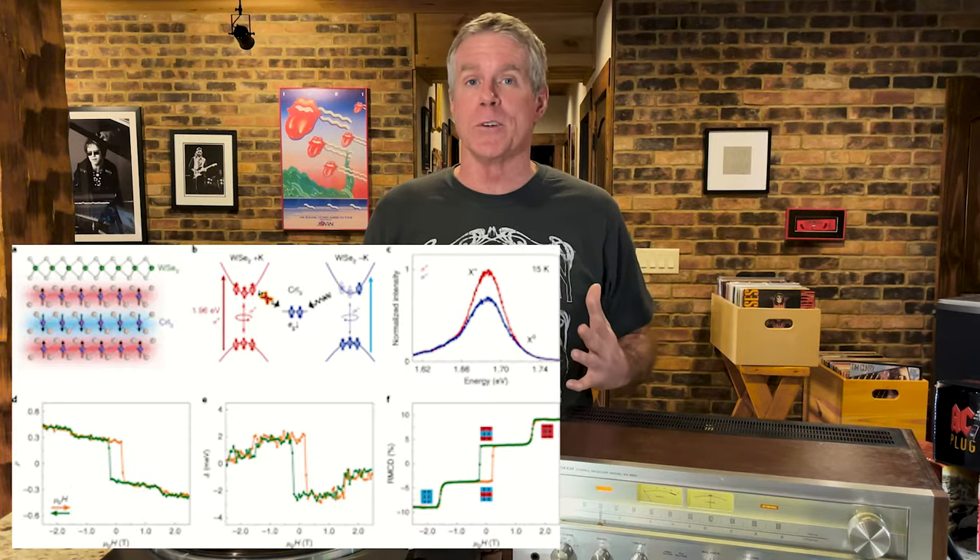That humming problem is technically called a ground loop, and the result is a 120 hertz hum, which is not to be confused with a 60 hertz hum. A 60 hertz hum is a gentle hum — it sounds like someone humming — and that generally indicates a proximity problem, where the components of your system are too close together or too close to another electronic device kicking out a large magnetic field at 60 hertz.